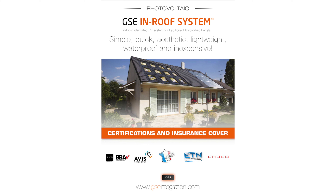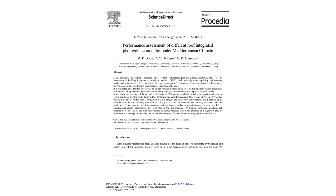I probably wouldn't go for in-roof if you already had a tiled roof - you wouldn't want the expense of having all the tiles removed. The other negative is that solar panels work best at a cooler temperature, and with on-roof you have ventilation underneath whereas with in-roof you don't. From reading different reports and independent papers, in real-life UK terms you're going to see about a four percent performance drop with in-roof versus on-roof. I'm happy with that four percent drop.